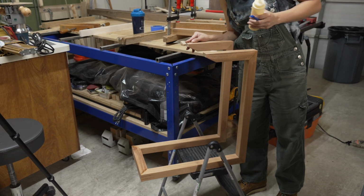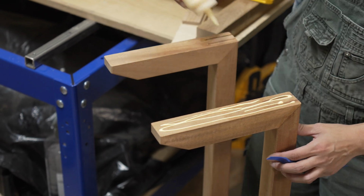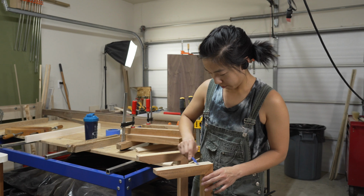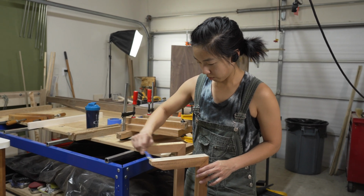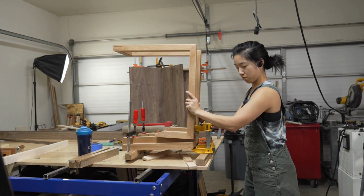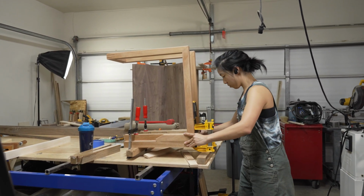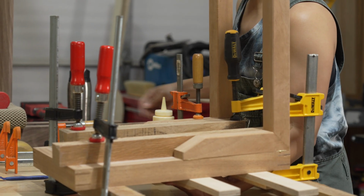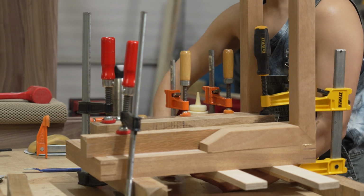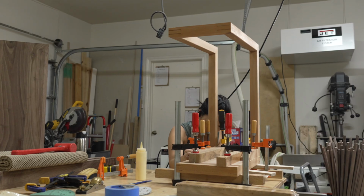Back in college, I used to goof these up all the time, and it was always because I'd approach them rather mindlessly. I don't know why, but I'd always chisel towards the corner of the joint, and what would happen is that a small bit of the corner would chip off. It's honestly a duh kind of thing, but it's one of those mistakes that I found myself making too many times to be proud of. Since those times, I've adjusted my technique, so lesson learned: chisel from the joint corner, not towards it.